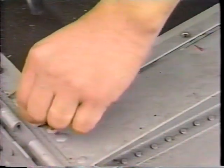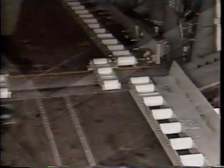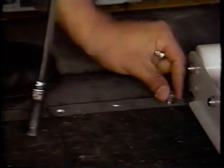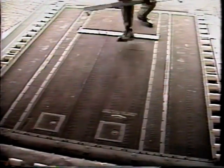Remove the bolts. Remove the three bolts nearest the extended left and right transition rollers. Using the two ramp roller mounting bar assemblies and the two inboard roller assemblies, mark and then remove the appropriate 12 bolts from the left and right center area of the ramp floor. When finished, place the removed bolts in storage.